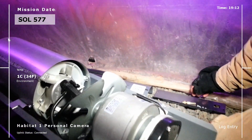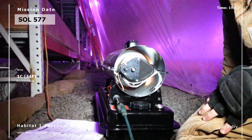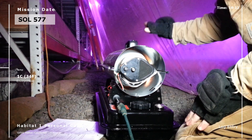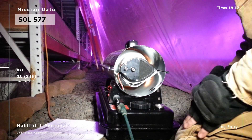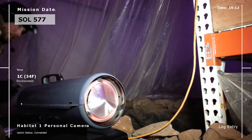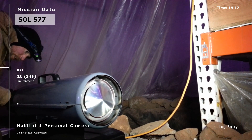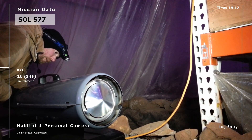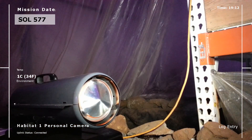We're going to have to dig in deeper here and see where the flow process is. There's a pressure adjustment on this particular unit, and I think what was happening is somehow it got jostled around. So I'm going to be in here adjusting the pressure to make sure the right amount of fuel is getting up here. The problem I was having is that I was getting incomplete combustion through the chamber — it just wasn't working. So I'm messing around with the pressure right now, just going from high to low. And it went to its shutoff state. Let's crank that back up — I should get a puff of smoke. Boom.